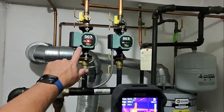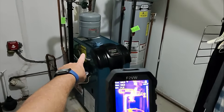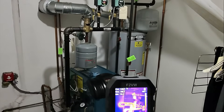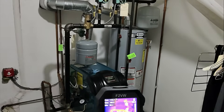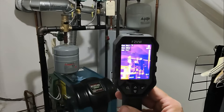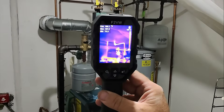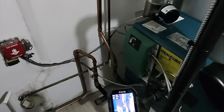Looking at a thermal scan of temperature. In the center of the screen, that's our supply pipe going across to the air separator. Below that is the expansion tank. Between the expansion tank and the air separator, right in the dead center, is our pressure-reducing valve. Right before that, upstream of it, is the backflow prevention device. Zone two — the second floor — just came on, and you can see it slowly heat up before your eyes. Now zones one and two are on, and that pipe going upstairs is heating up. The return piping is also heating up as well.